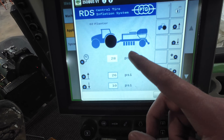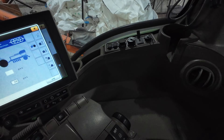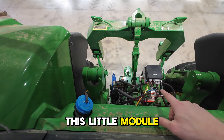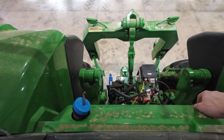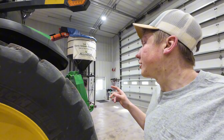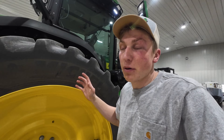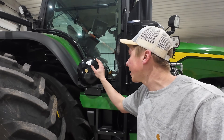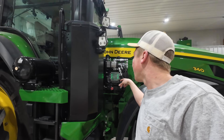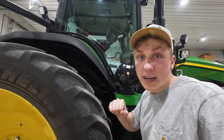If I want to adjust the tire pressure from 28 down to 26, I just hit this arrow up and now it is siphoning air — you can hear this little module back here taking air out of the tire. This is actually pretty new technology; I just learned about it about six months ago when we started kicking the tires on potentially putting this on our tractor. On the other side of the tractor there is an onboard compressor — if we need to add air to the tires it pumps from a pressure tank, and there's a hydraulic motor, a radiator, alternator, and everything back here that powers that compressor.